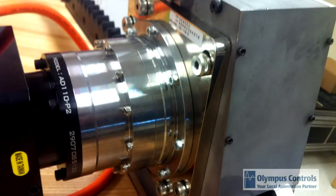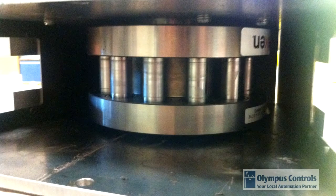You can see in the main housing we actually use a planetary gear head, and inside the housing itself, mounted right to that planetary gear head, is the roller pinion itself. This system can take about 800 pounds of thrust load capacity — that's dynamic, so it can move and provide 800 pounds of thrust. The peak or static force it can provide is about 1600 pounds, and we actually have a whole variety of rack and pinion systems that can go all the way up to 4700 pounds of static force.